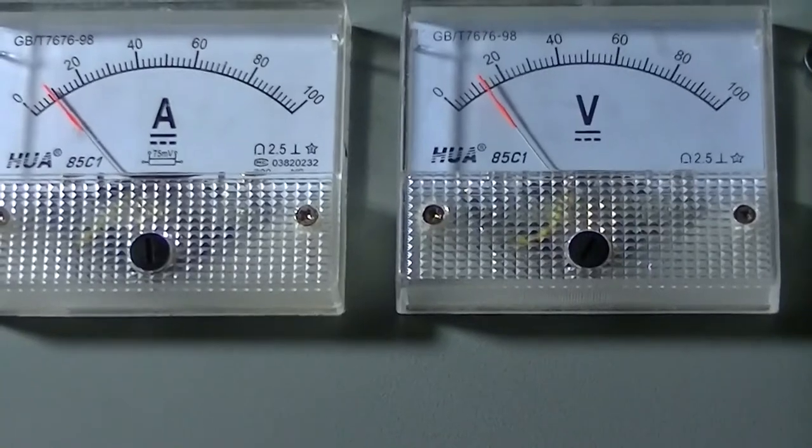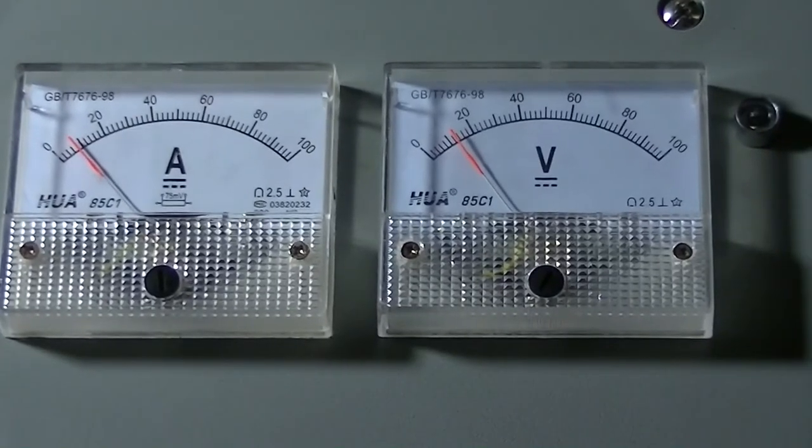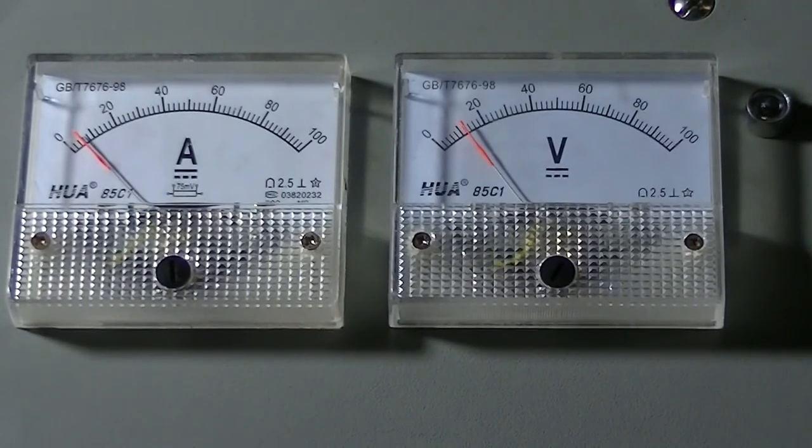That's basically about where I've been all day with this. You can see the blue LED blinking — once I get up over a higher voltage it blinks faster until it turns on the relay. It's 47, 52, 48, 50 watts AC inverted, and there's a 15 mile an hour wind. We just had a 21 mile an hour wind gust not too long ago — 14 mile an hour wind now and the winds are fairly steady today. It's been pretty consistent pushing 10 to 15 amps all day at about 12 to 16 volts — I'll take it.